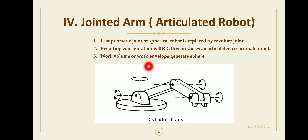The figure shows the articulated robot. The articulated robot is the opposite of the Cartesian robot in the sense that all three major axes are revolute rather than prismatic. A Cartesian coordinate robot has three prismatic axes or three prismatic joints, while an articulated robot has three revolute joints.